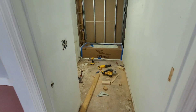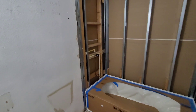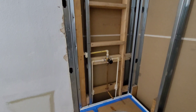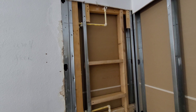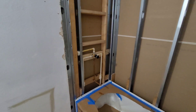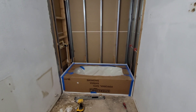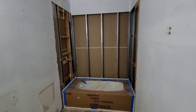Alright, a little update on what I'm doing so far. I finished framing the niche — that area right there is gonna be the shower niche. I supported all the wall, and all the plumbing is finished — my brother did the plumbing. Next step is I'm going to start installing the cement board on the back wall and then the side walls. I just finished that side there — I'm gonna show you some of the cement board that I'm installing.